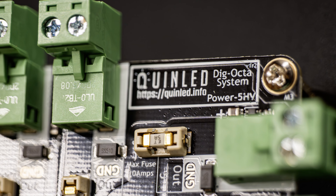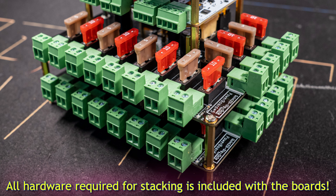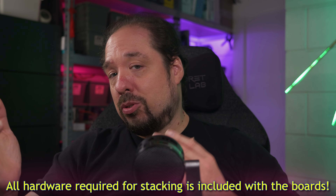Other than that, there isn't too much to say about this new power board variant — oh, it comes with the new logo already, that's a feature! All in all, I think this new power board slots in nicely in the Dig Octa system and adds another option when designing your LED setup. This board is fully compatible with the whole Dig Octa system, so you can stack it with other variants of the power board even with mixed voltages in the same stack — one power supply per power board. So say you wanted a single brain board with 12 volt LEDs and 48 volt LEDs attached — you can do that with a Power 5 and a 12 volt PSU, and a Power 5 HV with its own 48 volt PSU in your stack, and it'll automatically work as long as you connect the right voltage LED to the right power board.